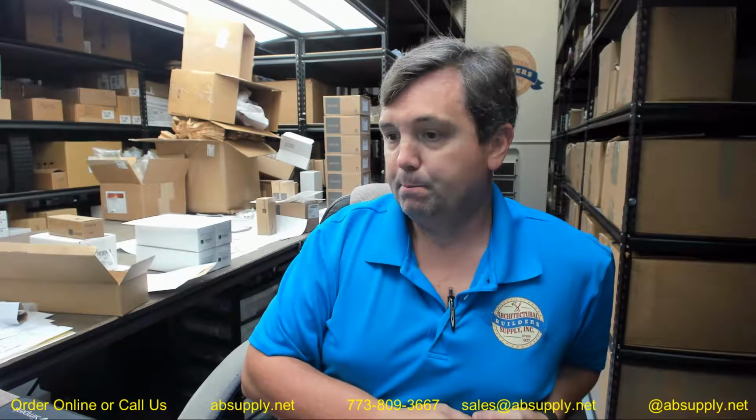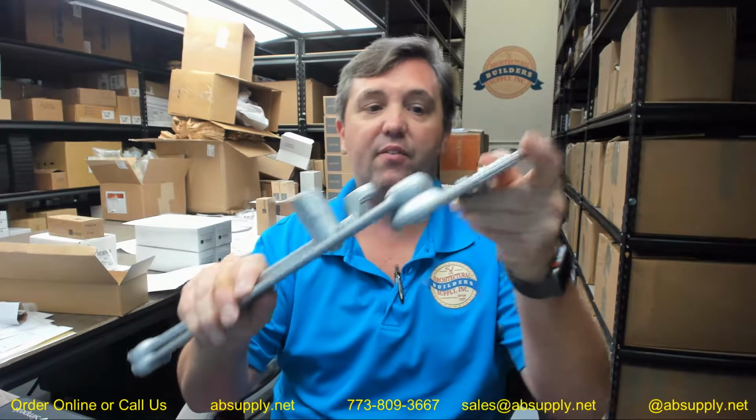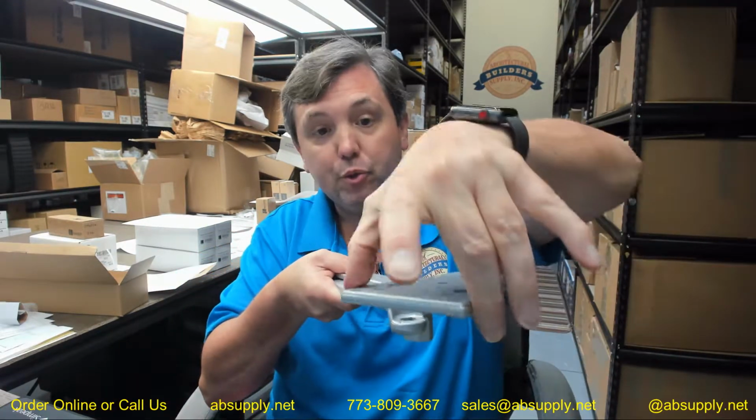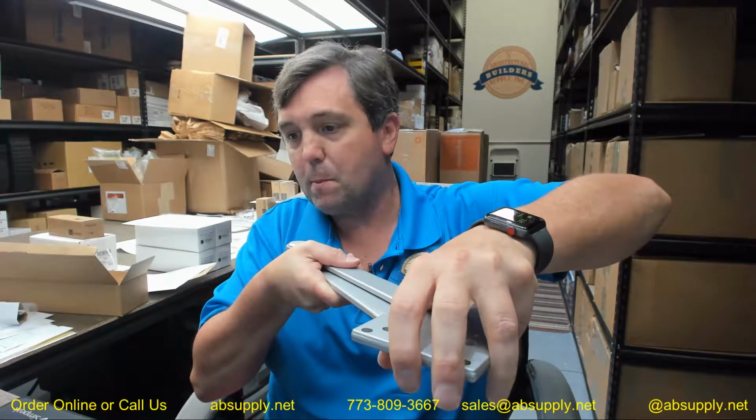And according to that extended description, we've got an extra heavy-duty hold-open arm, non-handed parallel arm, hold-open function, plunger hold-open, which means there's a spring-loaded sort of scenario that occurs between the holding mechanism and that ball bearing. Auxiliary stop in soffit shoe. That's the threaded insert that goes into the soffit shoe. This attaches to the soffit. That's what it's called, the soffit shoe.